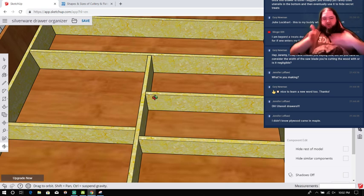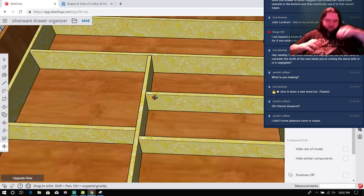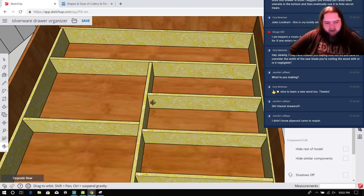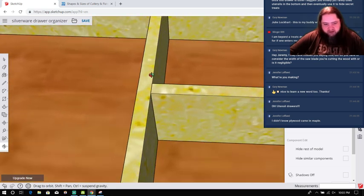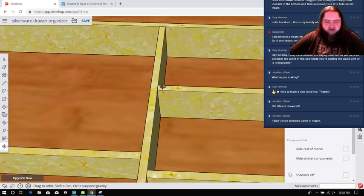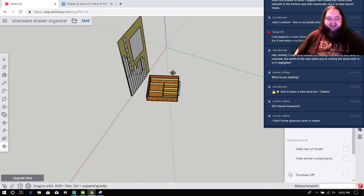I know if this was just glued on like that, you could potentially push it over, maybe break it or something. It's not really meant to hold a lot of weight or anything. But if it was slid into a groove, now it's got that extra support. But it's also only a quarter inch thick, so I'd have to take just a little tiny chunk out, maximum an eighth of an inch. And I don't know if I trust my table saw with only this much extra material.